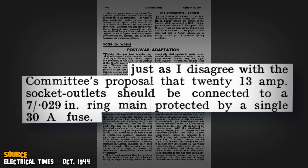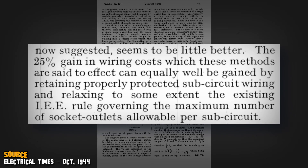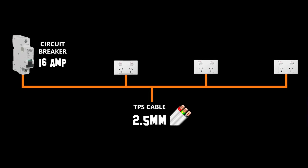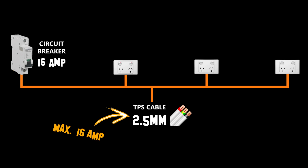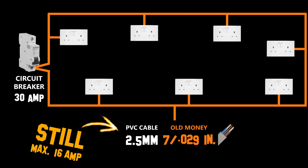Meg Ohm suggested an equally effective result would be relaxing the existing rules around maximum socket outlets. In the early 20th century, appliances didn't just grow on trees, so wiring a separate circuit and matching the load for each one kind of made sense. Nowadays we use maximum demand-based calculations for our circuit design, but the principle is still the same: ensure that you protect the cable from exceeding its maximum allowable current carrying capacity. This was even written into the original wiring standards in 1882. A ring circuit with a 30 amp fuse can be wired with a cable of a current carrying capacity of half that.